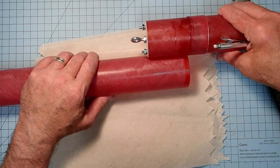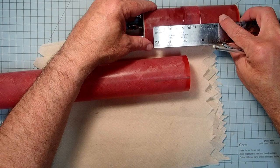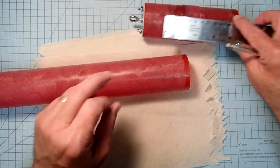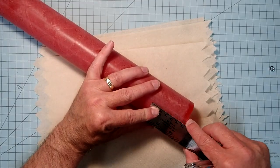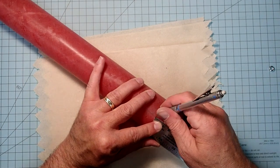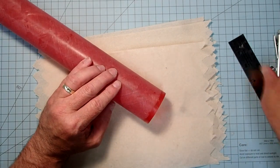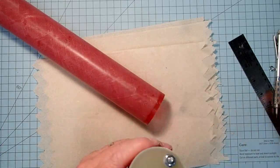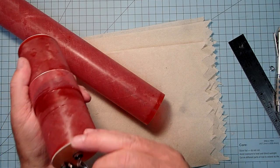If we measure this against our tube, right, I think 5 centimeters is going to be a good place to go, right about there, because that'll give it enough space up here to keep the strength of the tube, but it won't be so far down in here that it might be interfering with our avionics. So now I'm going to mark these lines. Okay, so this is forward. In fact, I'm going to mark on this. That's forward, and this one is aft.